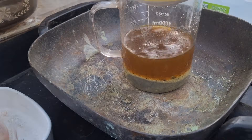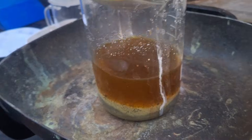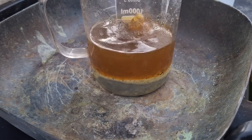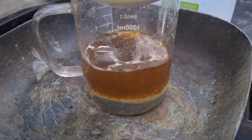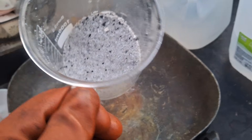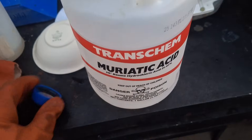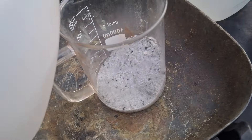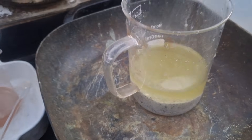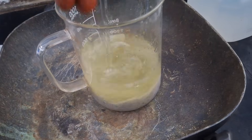That's been going for about five hours. You can see quite a bit of black material on the bottom now — that's the sulfur cooking off. After just two rinses with water it came out pretty clean. Now adding hydrochloric acid — a good amount since there's so much material — and giving it a stir to get it incorporated well.